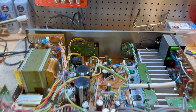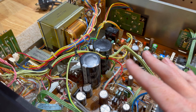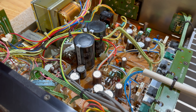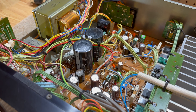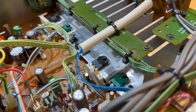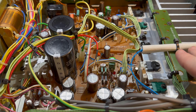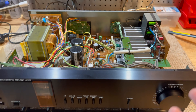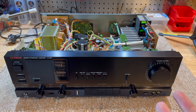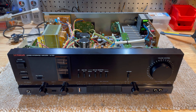You would have seen my time-lapse video and the amount of work that went into this unit. All the capacitors are top-shelf — Elna Silmic, Nichicon Muse, some films, Panasonic — there's no crap in this amplifier. All the MOSFETs have been redone with fresh thermal compound, the frame has been gutted, everything's been resoldered, and all the corrosive glue is gone. This is a passion project — there's no money to be made in the labor hours.